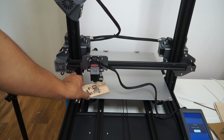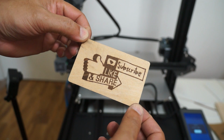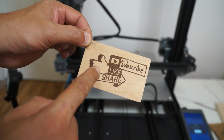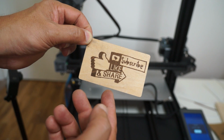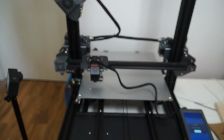Okay, now it actually did a good job, and it fit the size that I wanted. However, I see that it's not that black. This means I can still play with the speed settings. I can decrease the speed and decrease the travel speed as well to make it even darker and or deeper. Alright, so this is this.